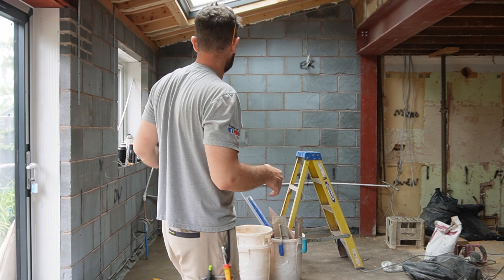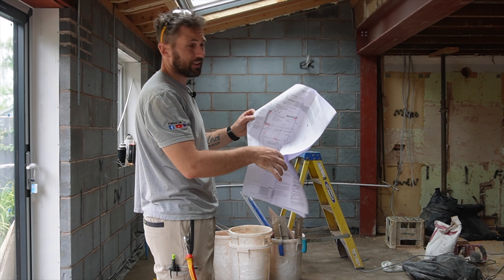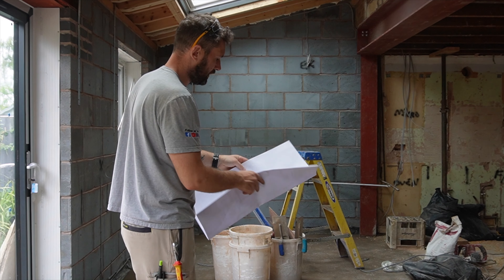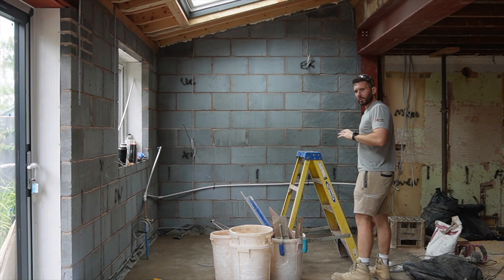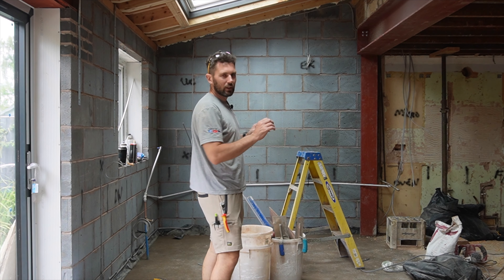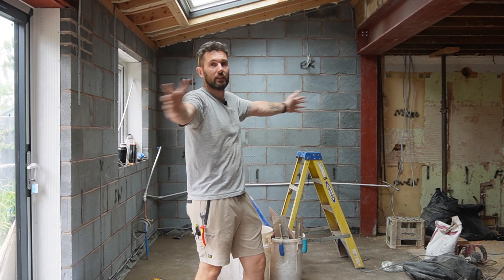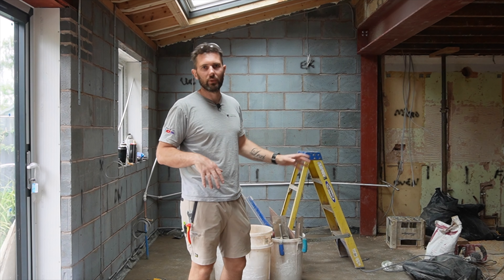What we've got now is essentially an actual plan, which is great. I've just been through with the client - you don't normally get a detailed scale drawing of where they want everything, which is fantastic. I'm starting to run all my cables through. In that microwave oven area I'm going to bring all my isolators back down there for the extractor fan, hob, and all that. I'll mount the back boxes once I've got a bit more measurement of where exactly to site those. We're going to put a ring in here for the rear extension. You could do a couple of radials, not a problem, but I'm going to do it as a ring - I tend to find it works better for me for the kitchen. The rest of the rooms will all be on radials.